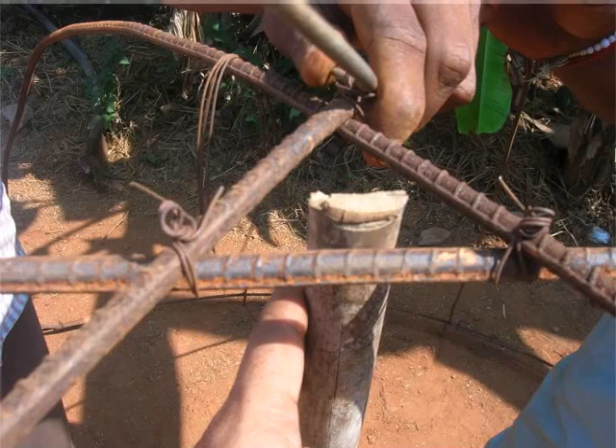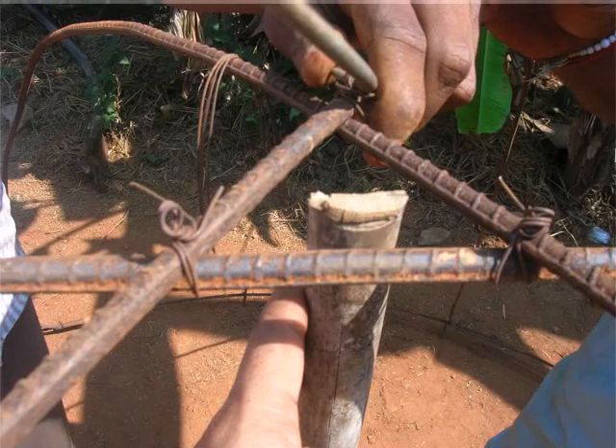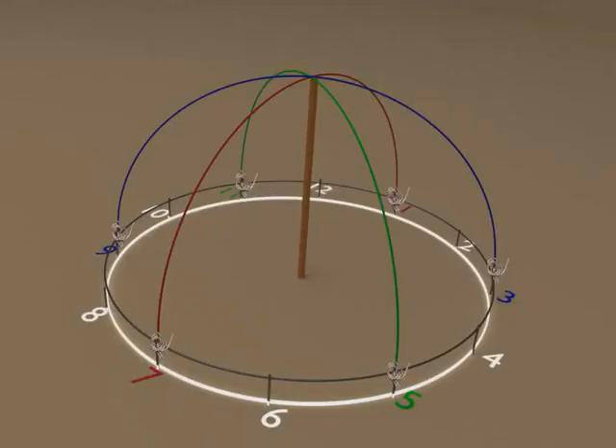The sides of the triangle should be approximately 2.5 inches. As shown in the image, the top view of the framework should look like this after tying. The mason shows the exact position of the open triangular gap using the bamboo stick. This gap is where the main gas pipe of 1-inch diameter will fit.